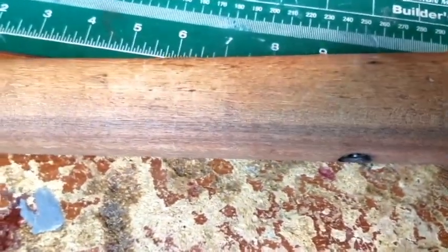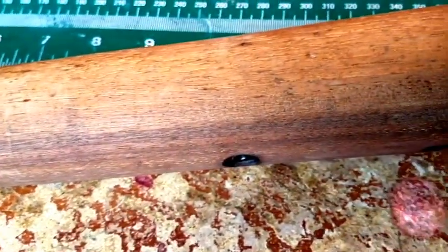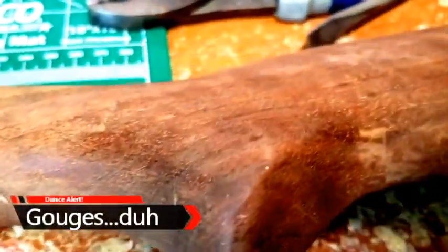Okay YouTube, another little update on this. I just got done steaming this. The wood is definitely lighter after it's been steamed because it's opened up all the pores in the wood. There's some spots that are still drying — I literally just brought this downstairs from steaming it over the kitchen sink. The dent that was in here — I can't even find it now. That's all gone. That area is still going to need to be repaired, as well as the cracks up here, but other than that the stock looks to be in good shape.